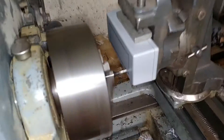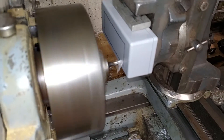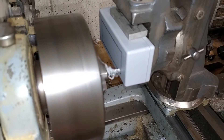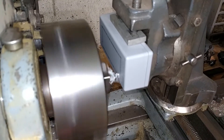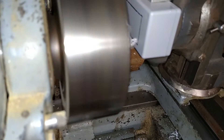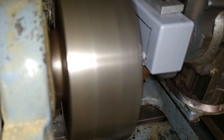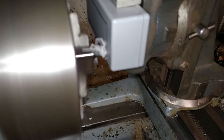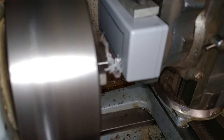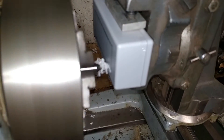We'll see how well I can do this one-handed. We're just going to go in about enough that we break through — and we're through now. Then we're going to start the carriage and go towards the line. Just hit it — and now we're going to go away from the line, down the edge here, and slowly cut our way across.